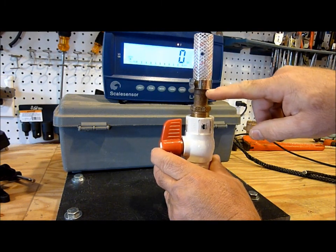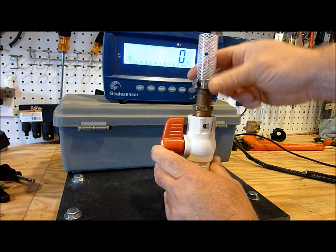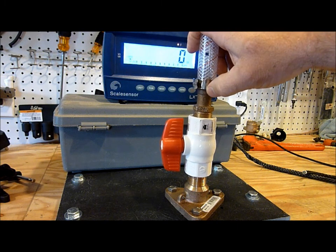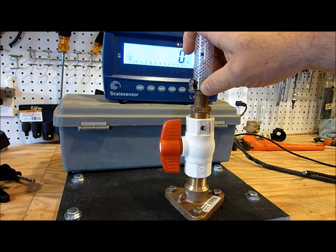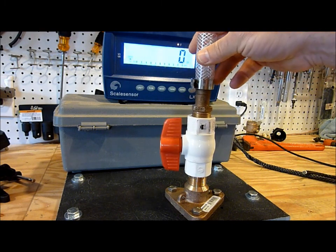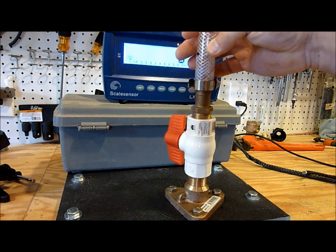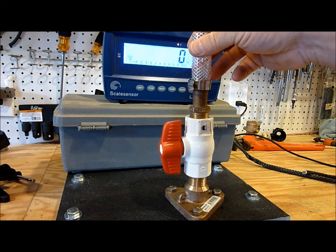That's why I was pulling here — which is a little bit below, because the hose clamp is literally just holding the line on. The ABYC requirement is that it handles 500 pounds at the innermost hard piping for a period of 30 seconds. We had some peaks upwards of 230, 250 in that range. But as the valve gave, it began to bend and the load would drop off a little bit.